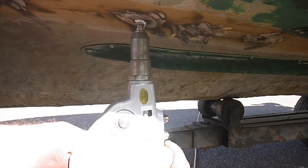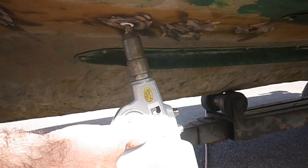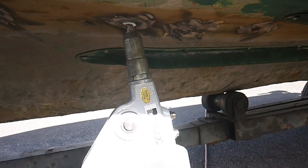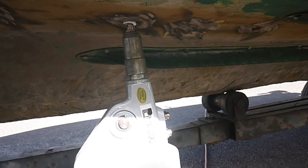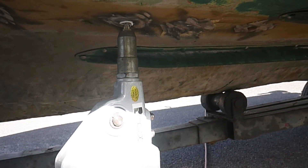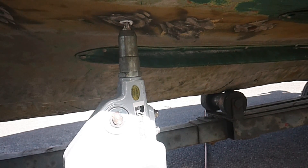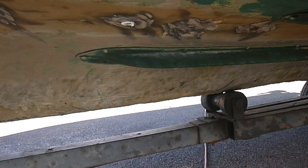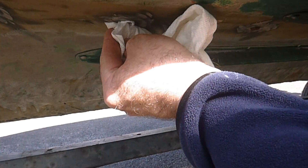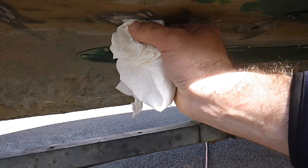Got the burr on the other side — put that rivet up, double-check the burr to make sure it's in place, and we're just going to send that rivet home. Now we're going to wipe the excess off, because we're also going to paint this boat later and I'm not sure the paint's going to like sticking to that 5200.